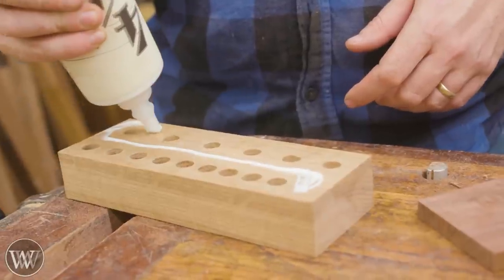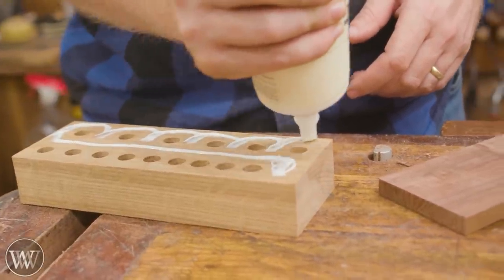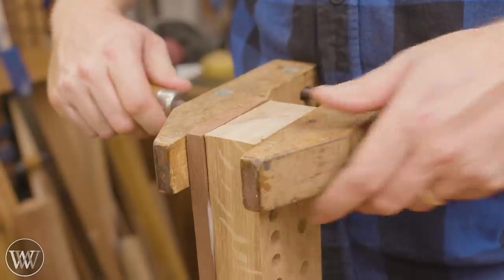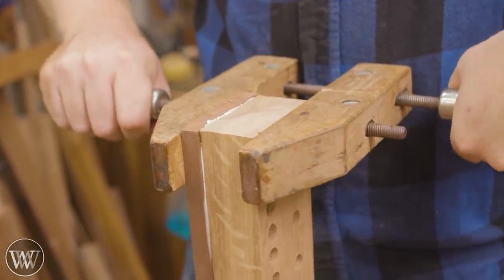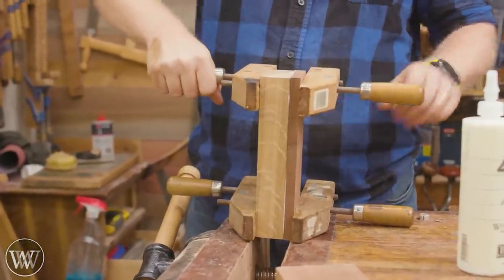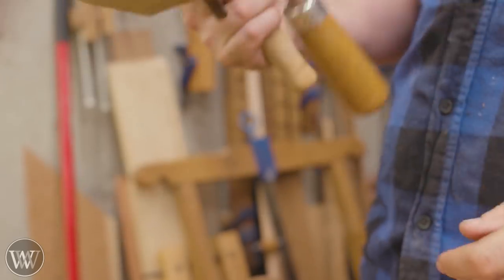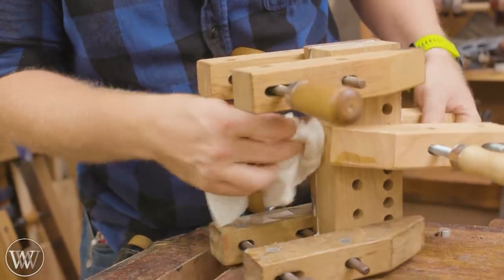You can see how this will then get clamped on there. Make sure we put enough glue on there to connect it. I'm actually using the new Four Quarters glue — you can get that at Tools for Working Wood. It's a nice glue, it's a fast set. So you can put it on there, clamp it up, and come back about 20–30 minutes later and have it functional so you can plane it and do more. I'm going to put a few hand screw clamps on here. If you've ever used hand screw clamps, they are phenomenal — I have so many in the shop because I use them constantly.